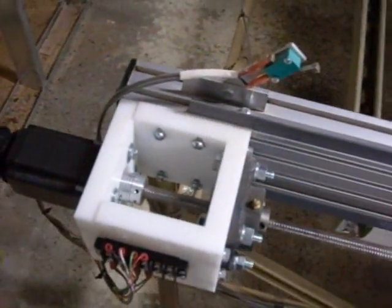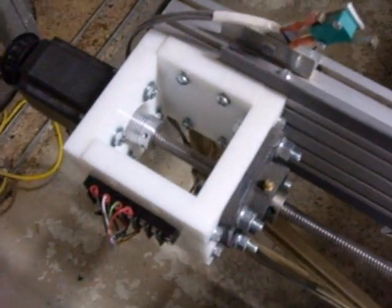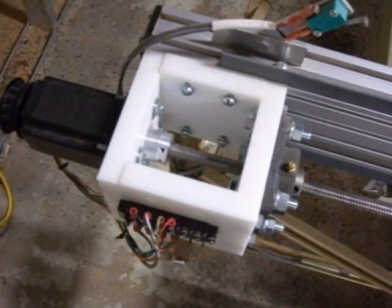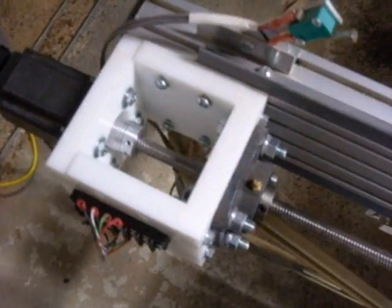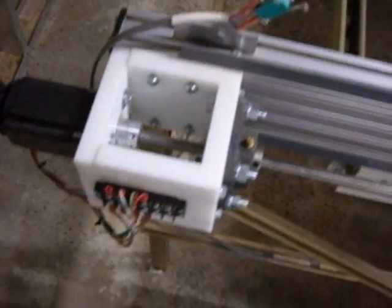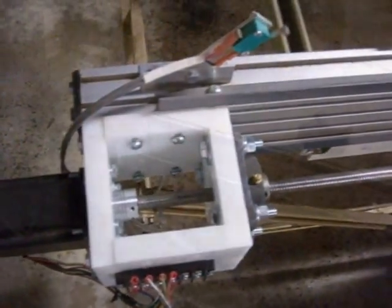After having a little bit of an issue with the dumpster CNC motor couplers slipping on the motor shaft and the quarter inch shaft — I used them for over six months after we switched over from Lovejoys — I'm going to try these new beam style split clamp couplers that also have a set screw, in addition to the clamping.